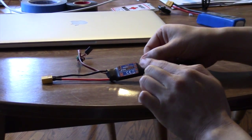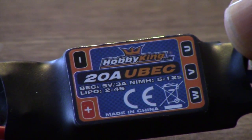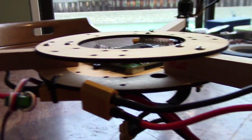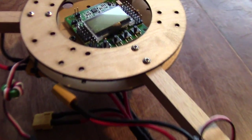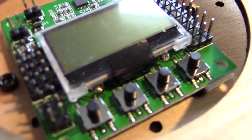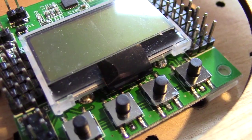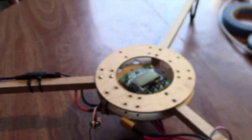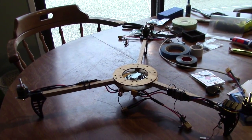Because it's made for an airplane, the programming doesn't quite work for a multi-rotor. Multi-rotors need to quickly adjust their altitude and attitude, and you need it to make those minute corrections. Supposing you fly on a windy day or if you're making acrobatic maneuvers, you really want your speed controller to send as much signal to the motors as quickly as possible.